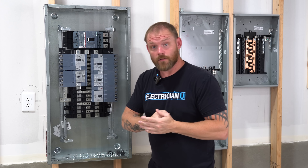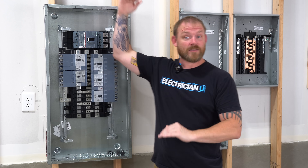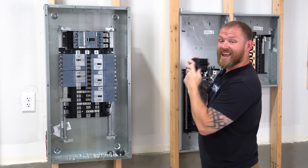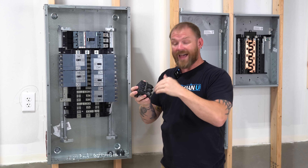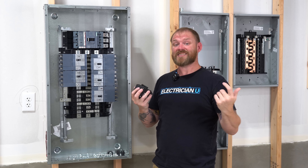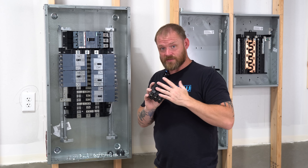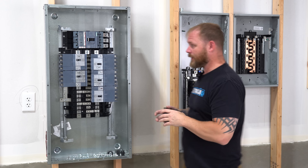A short circuit or ground fault happens usually at 200 percent or more of that breaker rating, and it needs to be able to trip. But there's also a maximum that the breaker can handle without exploding — that's what the AIC rating is. With these miniature circuit breakers, this has a 10,000 amp symmetrical effective max, meaning 10,000 amps is the max this breaker can handle. Anytime you have a short circuit, depending on the length and size of conductors, there's a certain amount of available fault current — you might have hundreds or thousands of amps. After 10,000 amps flow through this during a short or ground fault, this thing is going to be damaged. That's what the interrupting rating is — what's the maximum it can handle?